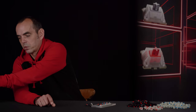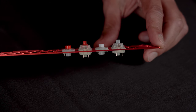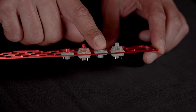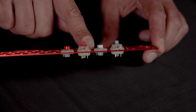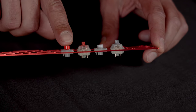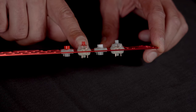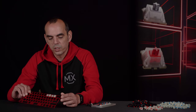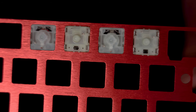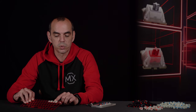In addition to the full size variants, we've got the Cherry MX low profile switches available in Red and Speed. As you can see the difference is in the height — the low profile are much smaller and thinner, so much thinner and lighter keyboards are possible than with the full size version. Unfortunately you can't use the same PCBs because the mounting of the switches on the PCB is different, so for the low profile versions there are special PCBs required.